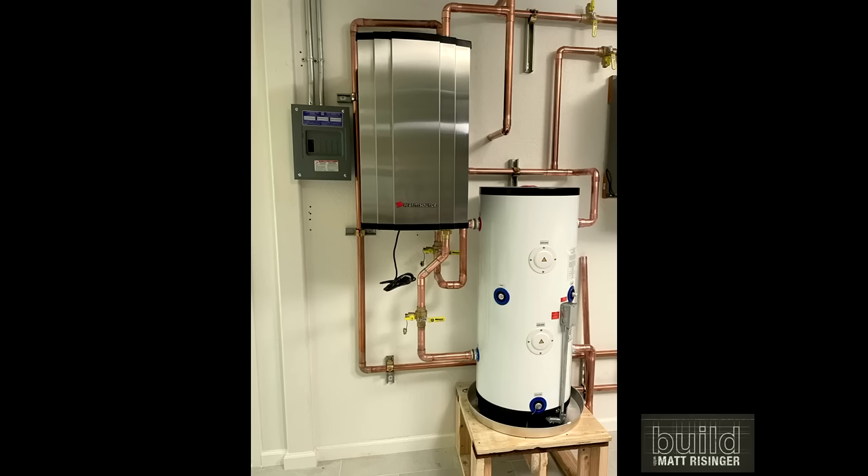The latest move is to go all electric. Our first option was an electric boiler. A COP — coefficient of performance — basically says: if you take a kilowatt of electricity, how much heat do you get out of it? If you get a kilowatt of heat out of a kilowatt of electricity, that's a COP of one — 100% efficient. That's just a restatement of the first law of thermodynamics — energy is conserved. But electricity is expensive, so you're burning a very expensive fuel at 100% efficiency. That brings us to heat pumps, which are a way of actually beating that number.